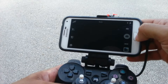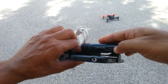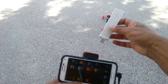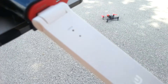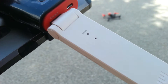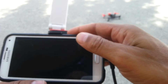I have a mini USB cable which plugs into the back of the controller, and a USB host — otherwise known as a USB OTG cable — that plugs into the phone's charge and data port. You'll see it recognizes it by the screen coming on. Next, I stick the battery for the Wi-Fi extender behind the controller with Velcro, then plug in the Xiaomi Wi-Fi extender. I press the battery's power button, and when the extender powers on it flashes yellow for a few moments. When a connection is established, it turns blue — meaning the extender is connected to the drone.